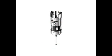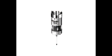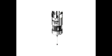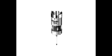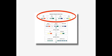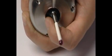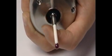If the probe is subject to high levels of vibration or shock loads, it may output signals without coming into contact with any surface. The enhanced trigger filter improves the probe's resistance to these effects by adding a trigger output delay to the trigger signal. The LED indicates the state of the enhanced trigger filter. To change the trigger filter, deflect the stylus for 1 second.